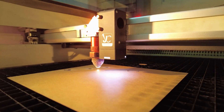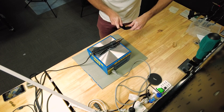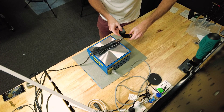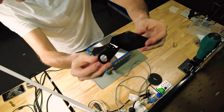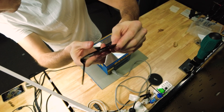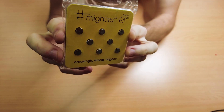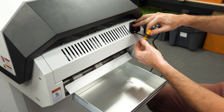Next I cut this acrylic bracket to hold the sensor. You can bend acrylic by heating it, which makes it great for prototyping these compound angles. First I bent the bracket to one angle that I wanted and then twisted it to create the compound — really straightforward. To mount the bracket I included deep etches to locate some magnets and they worked out as a really pleasing press fit.